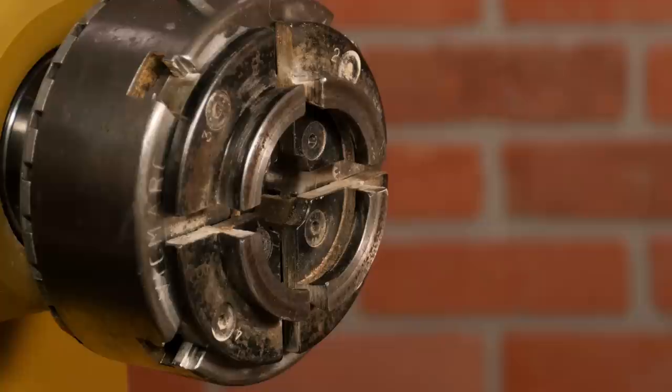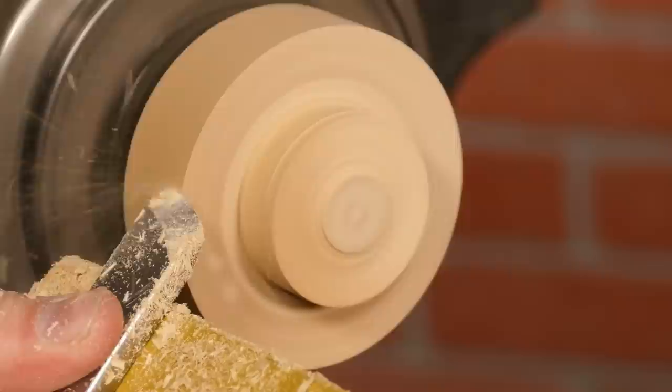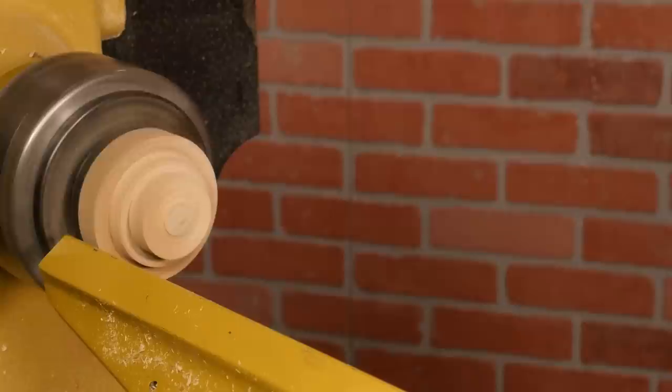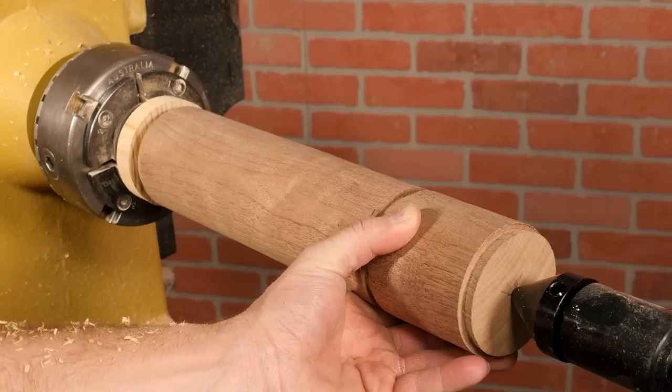Now that we're done drilling, it's time to prep for turning. Mount a 2 to 3 inch waste block on the lathe, either in a chuck or on a faceplate. Turn a half inch long tenon to fit snugly into the 1-5/8 inch diameter hole in the mill body — make sure to leave a small shoulder around the tenon. Test fit the size of the tenon until you have a snug fit. Mount the bottom of the mill body onto the drive tenon, then mount the mill head into the mill body and bring up the revolving center for support.